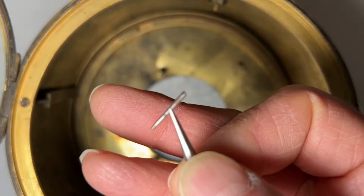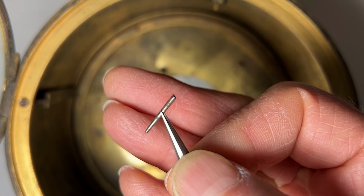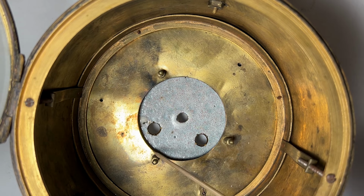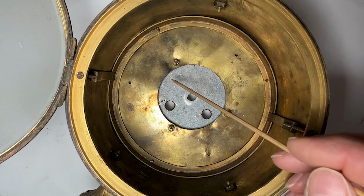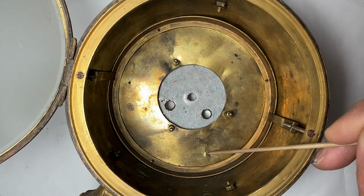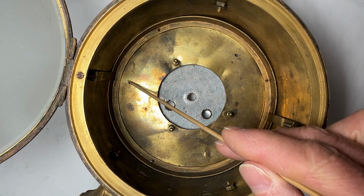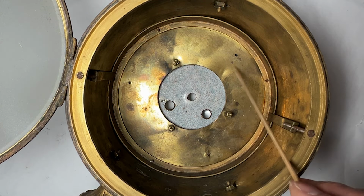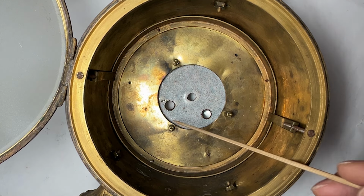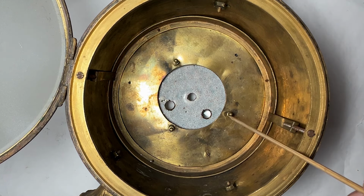One loose taper pin in the case. I need three. The movement is mounted on three dial pan posts. The porcelain dial is mounted through the dial pan by three dial posts. The posts go through the dial pan and have taper pins through the posts. Only one dial post is intact. The other two posts are broke off, so the dial is a little loose.